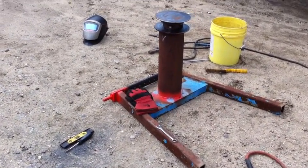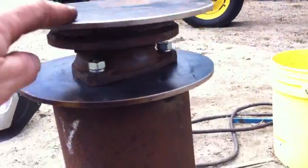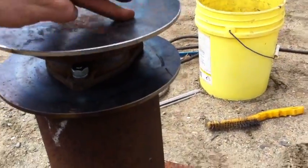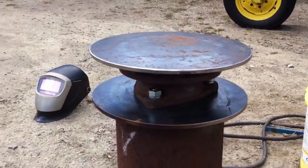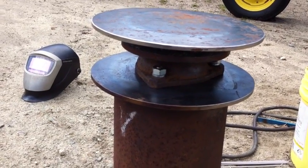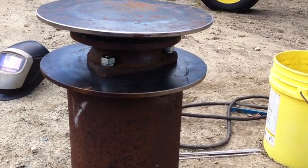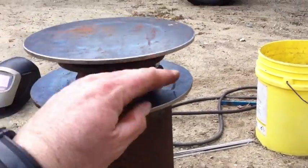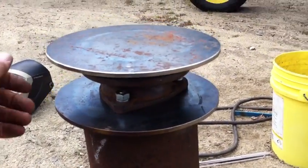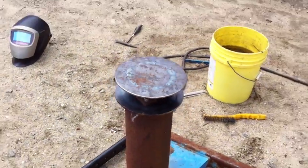I just got done welding this all together. The lower plate with the studs was welded to the bottom and the upper plate was welded to the top, so now we've actually got a usable pivot device — solid as a rock with no slop. When I'd been looking at hoists before at Harbor Freight and similar places, all the lifts were sloppy — just a pipe over a pipe. That's why we went with this idea. It spins really nice with just enough drag to stop itself from the bearing inside.